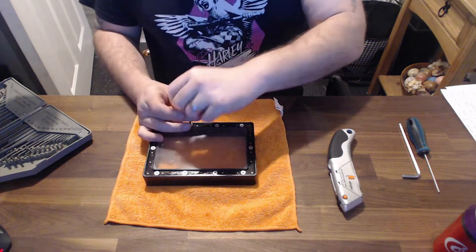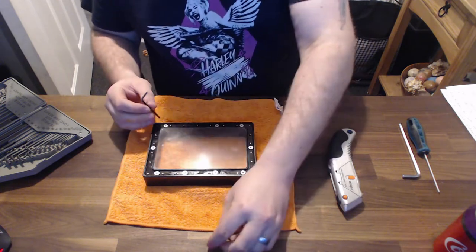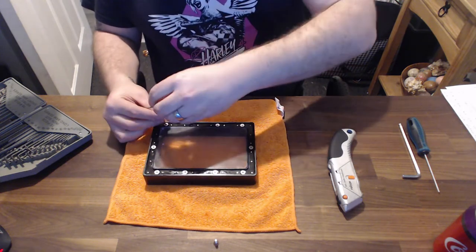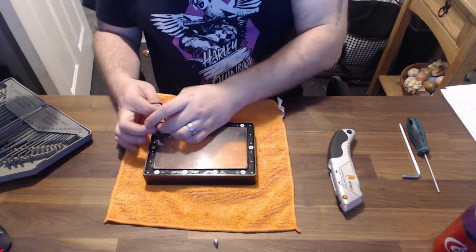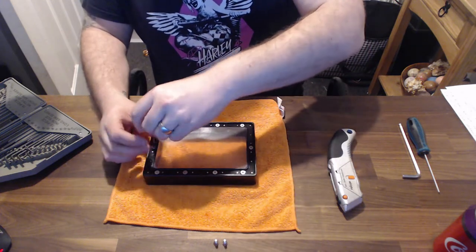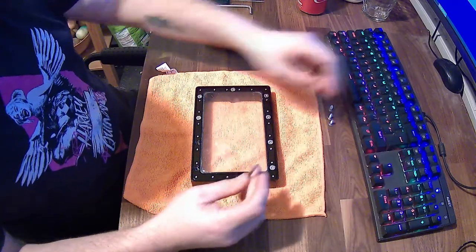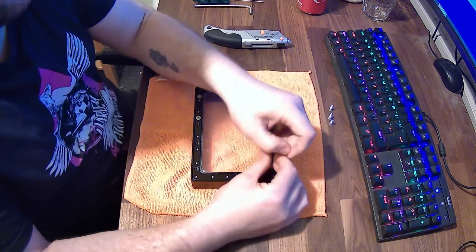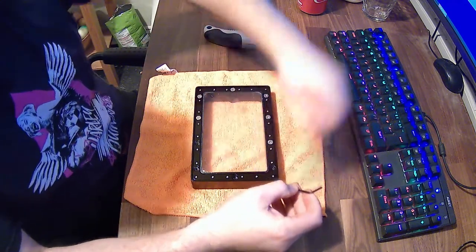Now these are your tensioning screws, so these screws don't actually get screwed all the way in when you put it back on — do bear that in mind and I'll explain that a little bit later. You're going to need an allen key for this; they don't provide an allen key that fits these screws in the toolkit that comes with the Elegoo Mars, which is a little bit disappointing. Luckily I had quite a few allen keys on hand and one of them fitted perfectly, so I'm just taking my time to make sure I don't damage the heads of the screws.